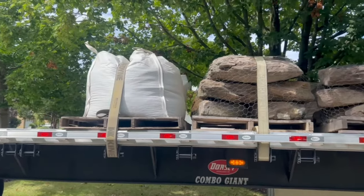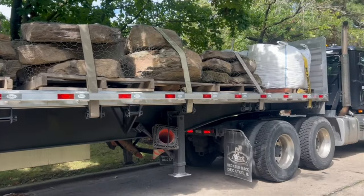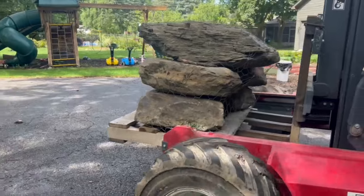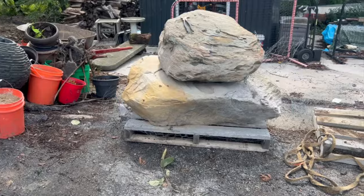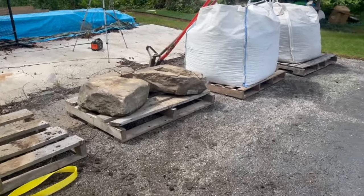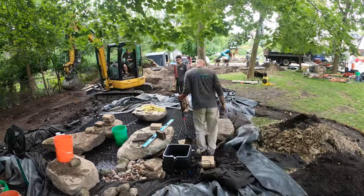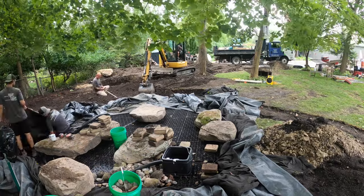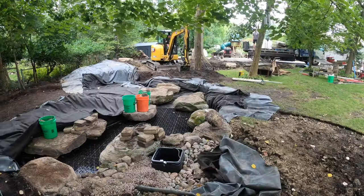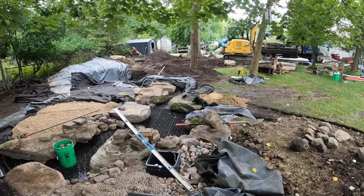This is a special project because we're using a stone we don't get to use too often — it's called Pennsylvania Fieldstone. It works perfectly when doing streams that have very low grade changes. It's not a stone that stacks on top of each other very well, but when you're going one or two high, it can look really fantastic. Almost all of it is tapered toward one end, making it really easy to do cool things with waterfalls. As we place the stones, the only thing I'm thinking about is how I want that water to twist and turn — replicating the way we see things twist and turn in nature. One of our challenges will be hiding that pump vault, but we'll just put one of our fake stones over the top.